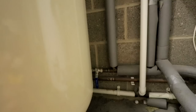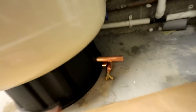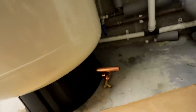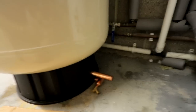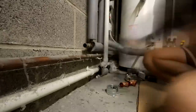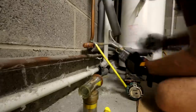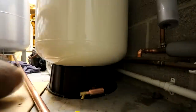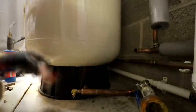We're going to have to cut this back further, which means we're in a danger area for soldering. We have to clean that pipe down really well — I really don't like soldering that close to old fittings. What I want is for the drain cock to go there facing the right way, and then basically elbow, elbow, elbow, valve. Let's risk it. I ain't messing around with this beast — we're going to get loads of solder on these fittings. I do not want them to leak once I've got this system filled up. There's a big blob of solder on the floor but we're getting this job done. Looking absolutely brilliant.